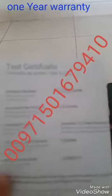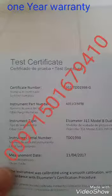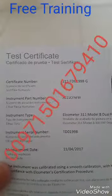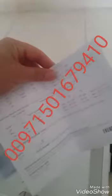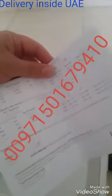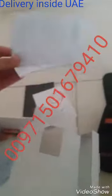This is the test certificate showing that the device is calibrated. If we look closely, we can see the certificate number, the instrument's part number, and the serial number. It also shows the calibration conditions — performed at the factory at a certain temperature and humidity — and shows the foil used for calibration along with the readings.